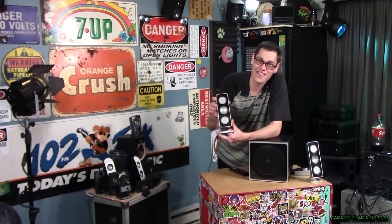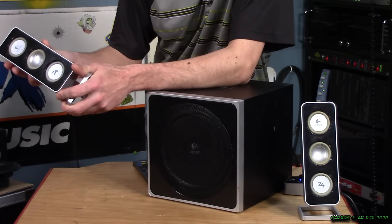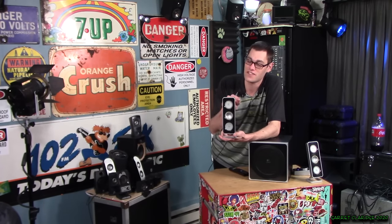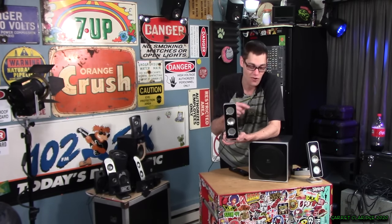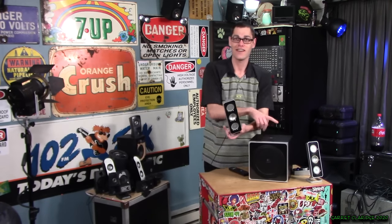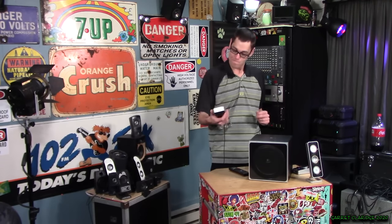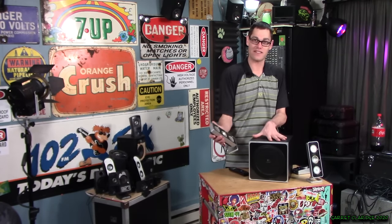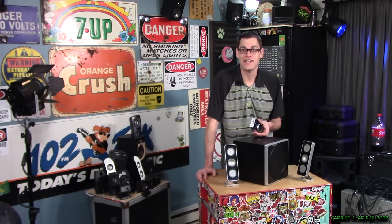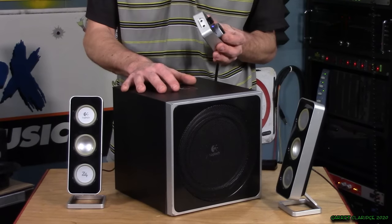Now these damn satellite speakers, there's passive radiators on here that are rendered useless because of the high pass filter that's enabled on here, and I'm actually very curious if it's a capacitor inside here or if it's something that's going on in the subwoofer, because that's going to determine if I'm going to keep the amplifier or not. I really like the volume knob on this thing. But the drivers and the subwoofer cabinet, no. So it sounds like the satellite speakers are getting a clean signal, but the subwoofer distorts right away.